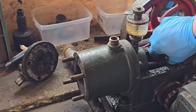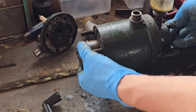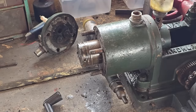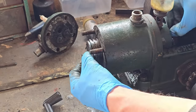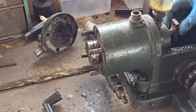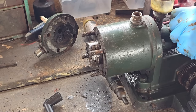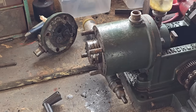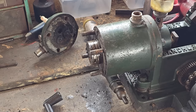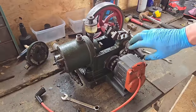Let's see if we can ease this piston out — we'll just give him an ease out and hopefully he'll come. The rings are free — look at that! I thought them rings might have been seized up. Right, that piston doesn't come out through that bore — it's got to come out the back end. That's going to make it a bit more tricky, I've got to nip them rings up because that conrod won't go through. And the conrod's been welded to this end, so we can't take this off. That won't fit through the bore — we're going to have to take that piston out from that end. We've got to strip all this gear out of here.